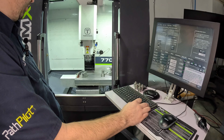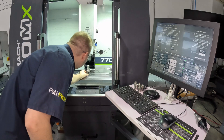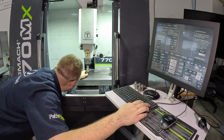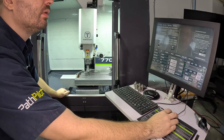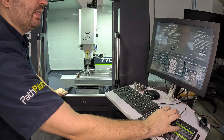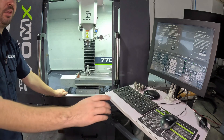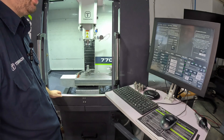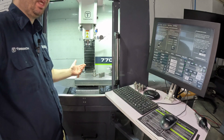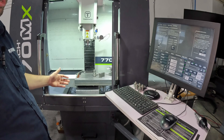Next, jog back up high enough to get our ETS on top of our reference surface and set it there. Jog back down a little bit, making sure we're between the drive dogs and not on them. We're going to hit the move and set ETS height button. We came down and you can see our height changed just a little bit, so we do want to make sure that's as accurate as possible. We now know the height of the ETS. So if we want to set our z-axis work coordinate, we can use the ETS for that.